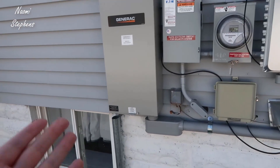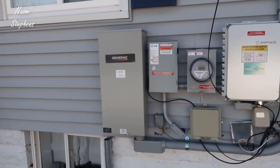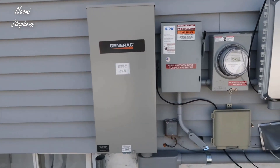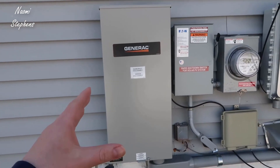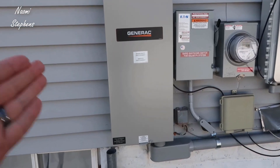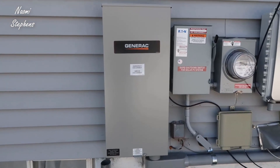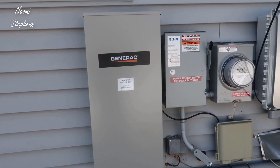As you can see, this box takes up a decent amount of space — we're just utilizing it here next to all the other equipment. The house has solar, which is why we have two meters, and this box is for the solar. Basically this allows us, during a power outage, to have a point of contact — a middleman between our main panel inside the house and the rest of the system coming off the grid from the town.